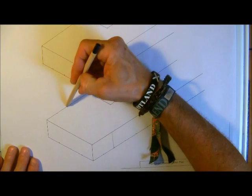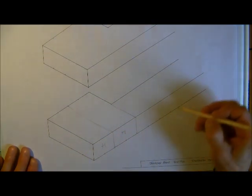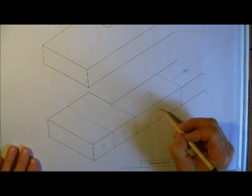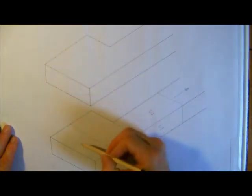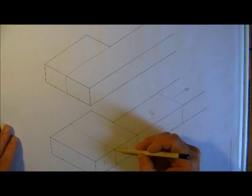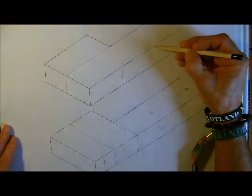Very simple, and as we mentioned only one cut. It looks good and it's quick to do, but we do just have that little problem on the back that we have to think about. So if we go to the traditional method of how they used to do this, we will start off with the header this time. And how they used to do that would be with two headers on the end, and again they would then go off to continue with stretchers. So again this is a stronger method because we don't have that straight joint there.